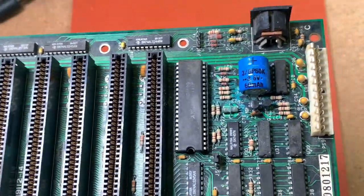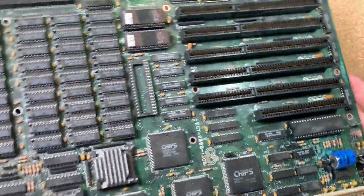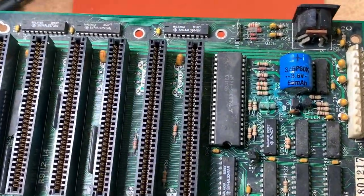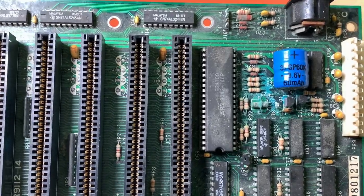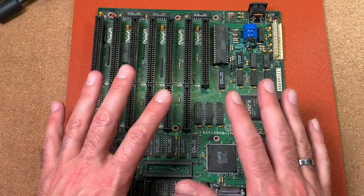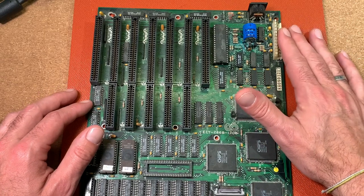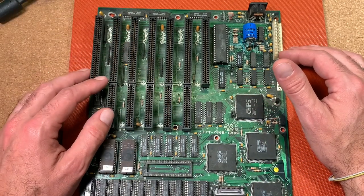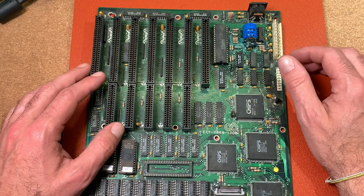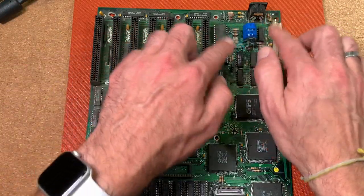Normally I don't like to mess around with these kind of batteries and these oxidations, but for this nice rare 286 board I thought to give it a try, and maybe we can fix it and it's still working. So usually what I'm doing is, before I start to invest any time restoring, I will just apply the board and put a VGA card to see if it's posting or not. If it's posting, we have a good chance that everything is working at the end, and we will go on with our cleaning and restoration.